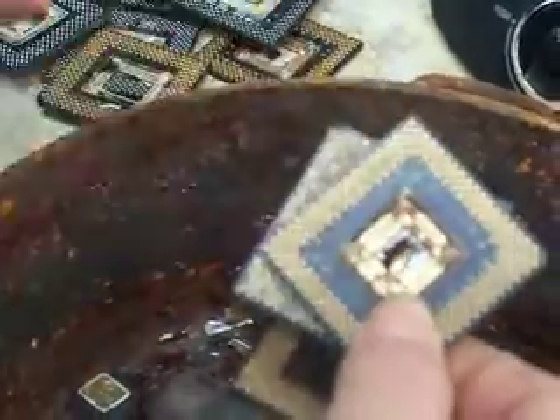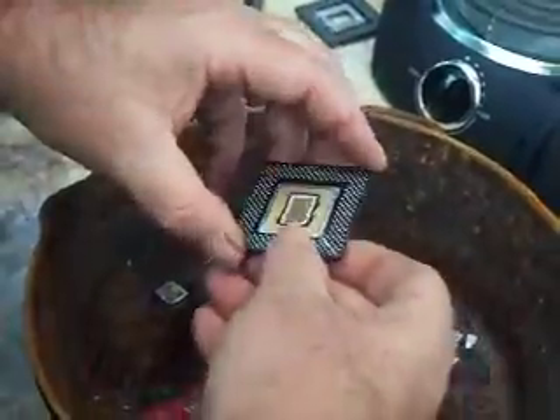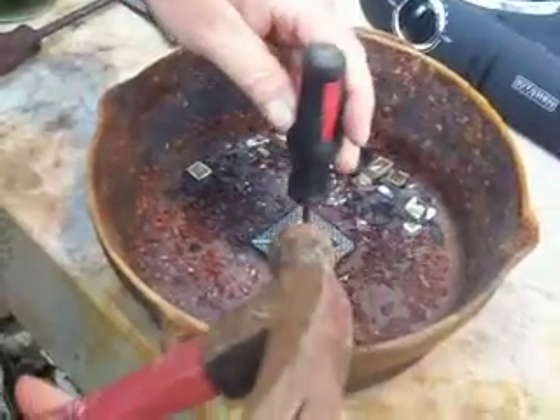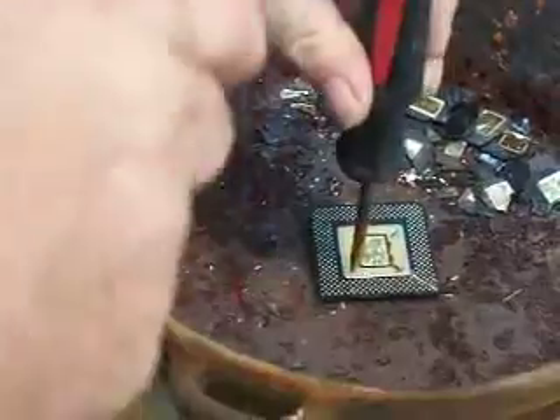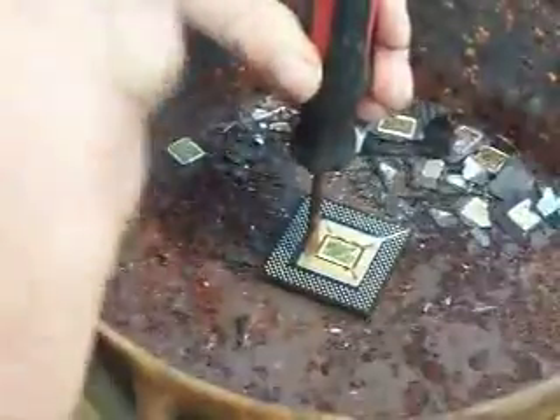You want to make sure that you get as much of that resin as you can, because that's where your bonding wires will be. Now this is how I do it — take my special tool, put it in that corner diagonally, just like that. The chip comes out, all the resin's out, now this piece is ready to be processed.